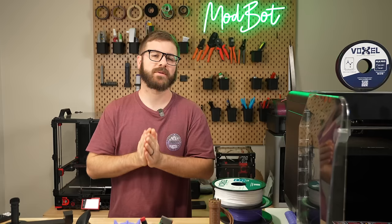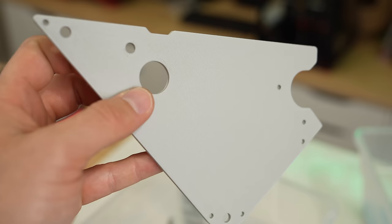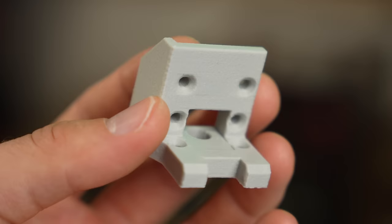When I switched over to printing Journeymaker Positron parts in Soraya Tech's glass-filled ABS, I turned the heater back on. This time, when each print finished, I opened the front door and gave the printer roughly 15 minutes to cool down before pulling the plate and firing off the next print. Yes, this meant a delay between jobs, but I got through all of the parts without having to adjust the Z, and it's been going strong ever since. Even on the larger pieces, I had zero issues with warping.